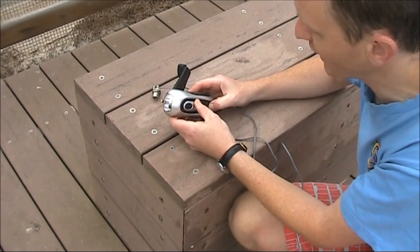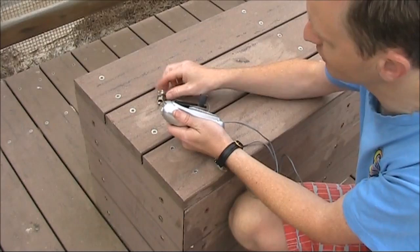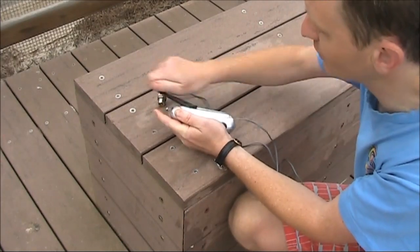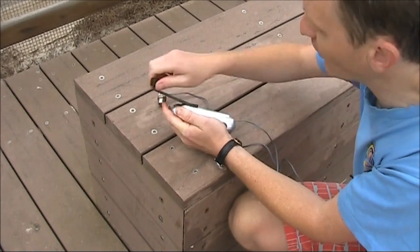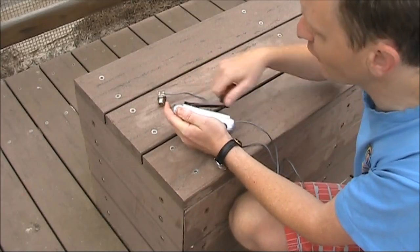Here's mine, built in a hand-cranked torch. There are no external parts except for the wire to the antenna connection. You crank the handle and press the key, and this will transmit a CW signal — in this case on 7 megahertz. Output power is around 500 milliwatts, enough to be heard hundreds of kilometres away under favourable conditions.